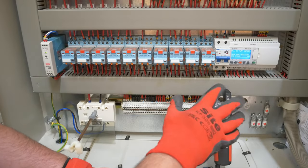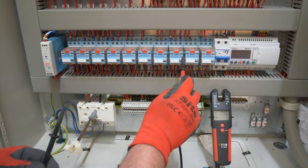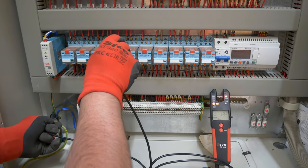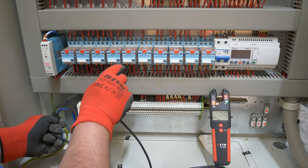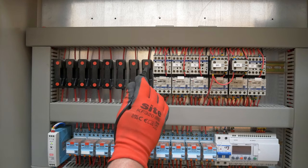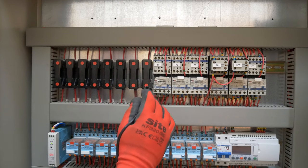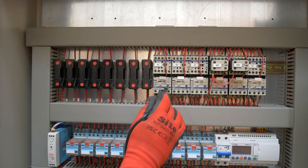You can see here we've got the 24 volts coming in, the DC inputs along the top, and our relay outputs on the bottom going in pairs through a switch essentially - to turn on and off based on input commands coming into this relay. Here we've got some AC 230-volt relays - so these are mains voltage. If we hold one end of the probe onto an earth and go across here, you'll see with the GS38 probes we've got 245 volts. On the output terminals the same - so if these relays are held closed by the commands on the front of the panel board, this will output voltage based on the selections you might have.